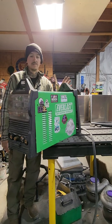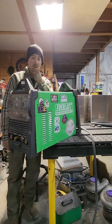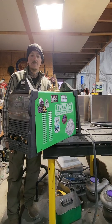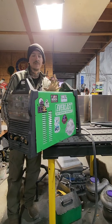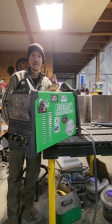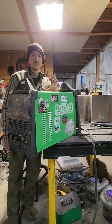I've had this machine for almost five years and I'm noticing that on AC power when I'm going to weld aluminum, my arc is kind of all over the place and taking a few seconds to establish. So I know it's getting time to adjust my points, and I'm going to walk through that with you guys.